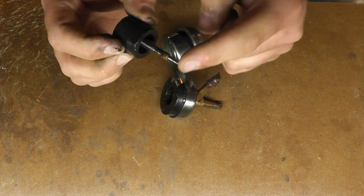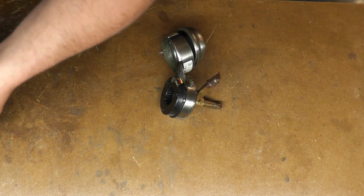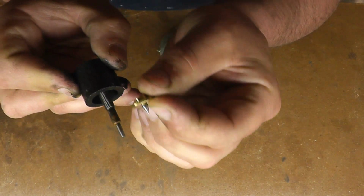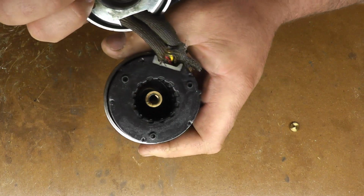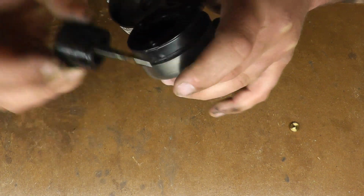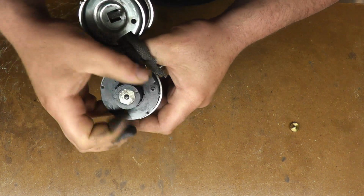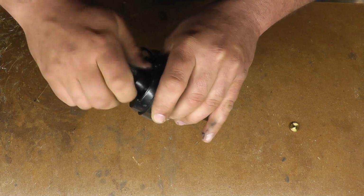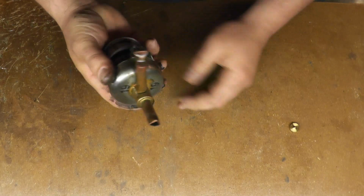So this valve seat right here, this is basically the same thing as that. Alright, and you can see, let's see if I can get right down through it, and there's the seat. So basically you can see it's threaded there, and what will happen is the circuit board will tell the stepper motor to either screw in and close this down, or screw out and open it up. It's absolutely ridiculous. There is no need for this garbage at all.